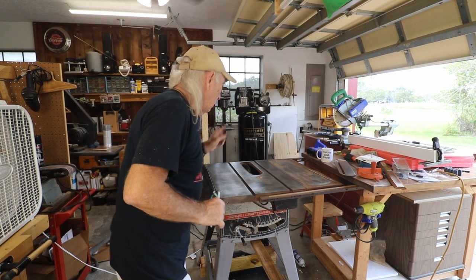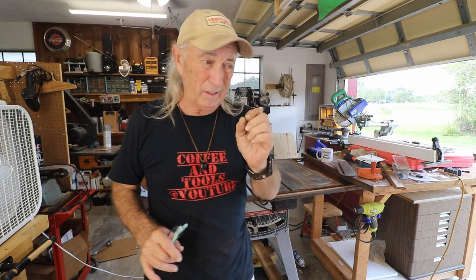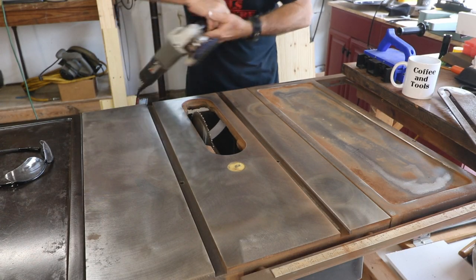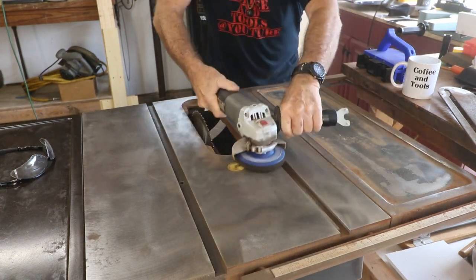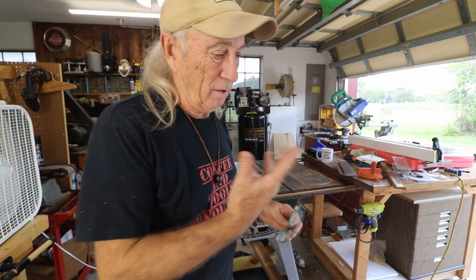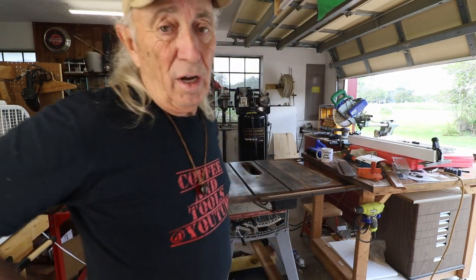One real quick word though — when you hit an edge or a metal edge like that, those little pieces of plastic that are on the blade of that thing fly off. And if they hit you, it hurts — like it stings. I've messed up my paint job here a little bit, but looking good. Be very careful, and yeah, safety glasses are a must. Probably should have an air mask. I've got a really well ventilated system here blowing all that rust outside, but just put it on an angle grinder and man, you just knock that rust off in a hurry.